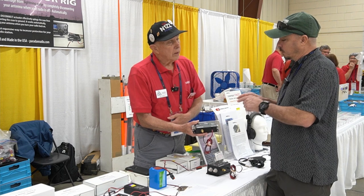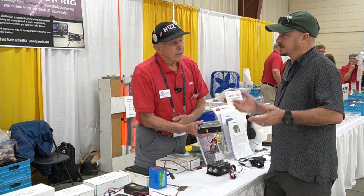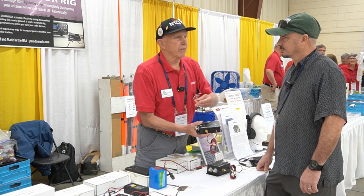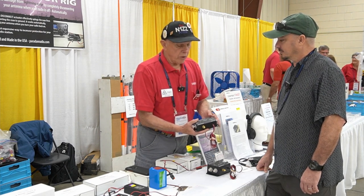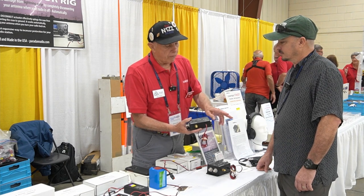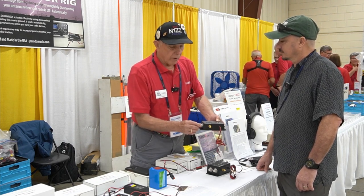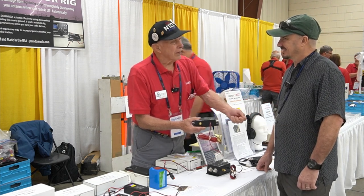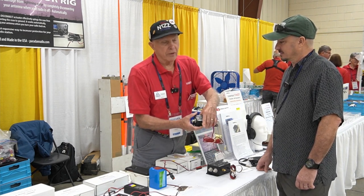Now I'm curious — do I need one of these for every antenna I've got connected? What if I've got two antennas, say one UHF, one VHF, and then my HF antenna — do I have to buy two of these? This does not work on UHF and VHF, because the spacing of the heavy-duty relays is incorrect for proper SWR. What I've done when I've had this is I put my alpha delta switch — which had four antennas on it — on the antenna side, fed that to here, and then this went to my radio or power amplifier or tuner. So now you can just switch between antennas, and all the antennas through the alpha delta switch can be shorted to ground through this in the safe mode.